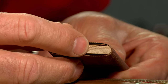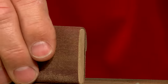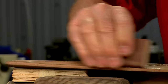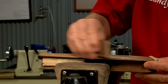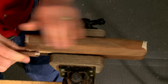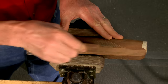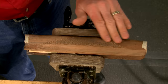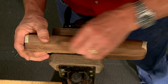The finger grooves can be easily sanded with the rounded edge of the backer. Notice the craft sticks that I'm using to keep from crushing the fore end. I'll stay away from the checkering and both ends until the final sanding with 220 grit. Again, I'm careful as I don't want to remove too much wood. The last step is a final raising of the grain.